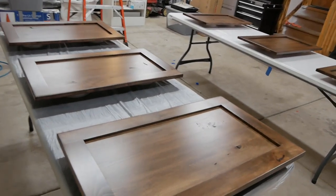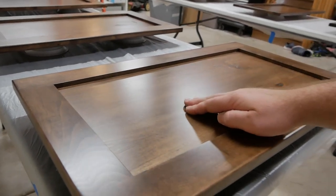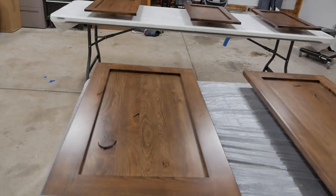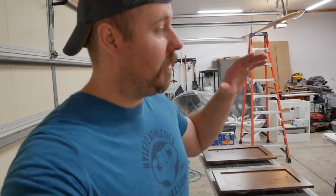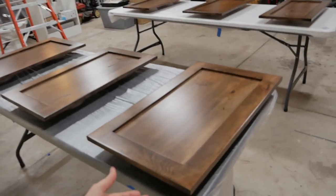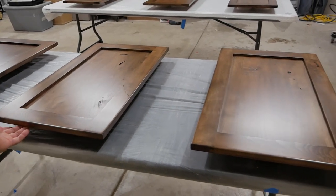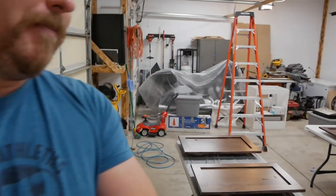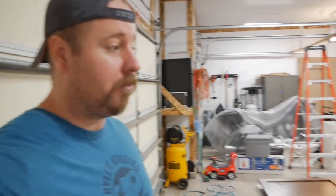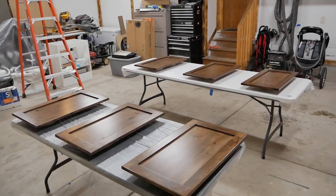Here are all the doors about 20 hours after that second coat, and as you can see, this stuff laid down super, super smooth. First time using that water-based polyacrylic, and very happy with it. I'm going to let these dry for another day, then get them set up downstairs on the cabinet doors. It should be said that this is not the ideal way to paint cabinet doors — really you want to paint every surface at the same time, so these probably should have been hung up instead of laying flat. That said, I really don't have any overspray on the undersides. The polyacrylic dries very fast in the air, so it worked out pretty good.